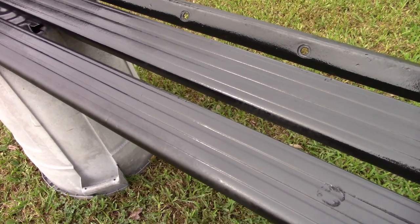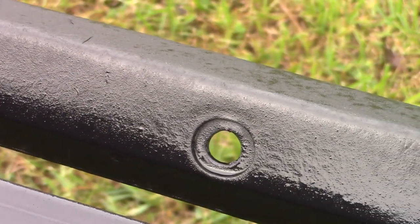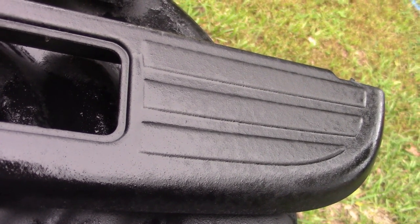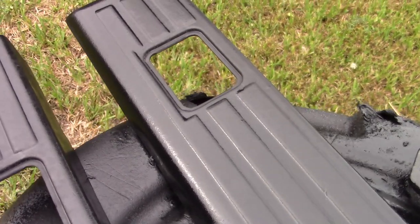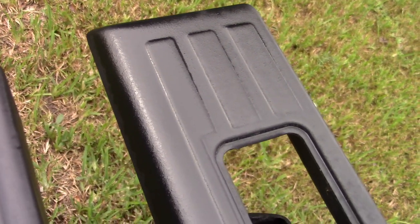Here's the result on that first coat. As you probably noticed, I put it on real heavy on the first coat because I was imagining it was going to soak in - and it seems to be. You can see right here it's turning a little pale, meaning it's absorbing. Over here it's still pretty wet. It will do the texture finish, but if you put it on heavy like I was doing, it's not really doing it. Here's an example - that's starting to look like it right over there. So now that I have the heavy coat on, I think I'm going to give it another coat farther away to start working on the texture. That blemish was already on there - that's not from the paint. I'm going to work on the texture on this last coat - it'll be a faster coat farther away.